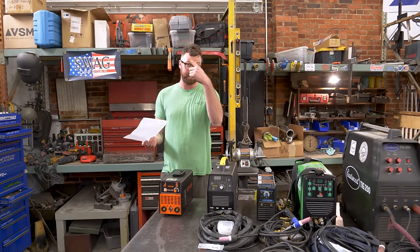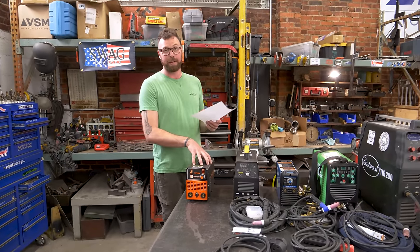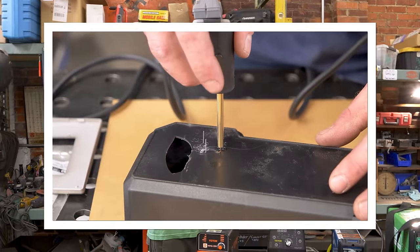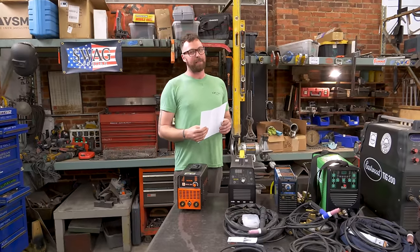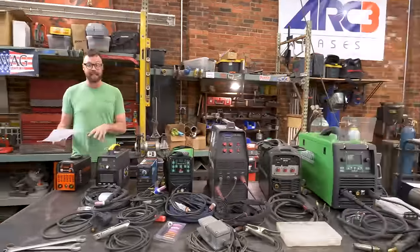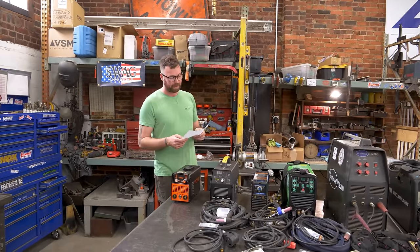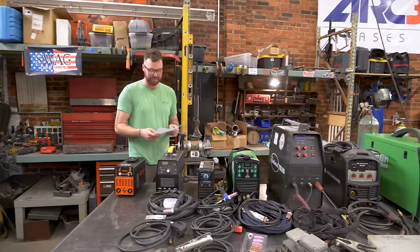The interface is super easy, and if you know how to stick weld, this welder is pretty easy. We have stick welded with this. Plastic welding is easy and pretty self-explanatory — this is the only welder that welds plastic. Really it's not welding plastic; it's heating up metal curls and burning them into and across a crack in plastic to bridge it back together. Hot stapling is more accurate. That is a cool feature, and I think that is what this welder is going to serve the shop — if I have to fix plastic in an extravagant way, that's what this welder will be used for.